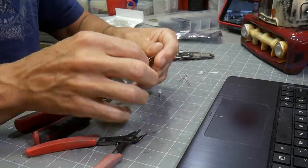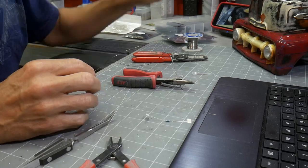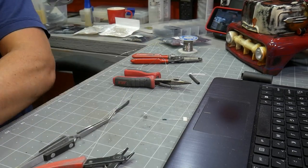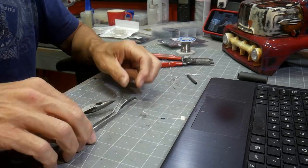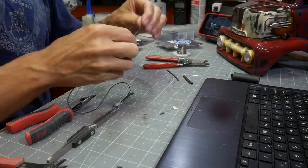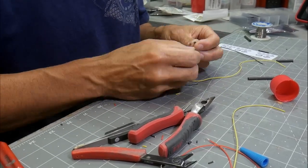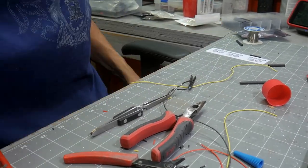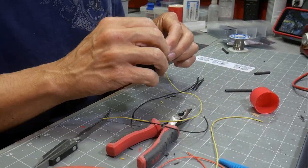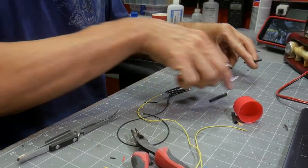One of the fun parts for me is doing the wiring. For the LEDs you use a resistive dropper — just go to any number of websites that help you calculate what resistor to use. You put in a couple parameters, pick the resistors, wire up the LEDs, and you can get really bright or really dim LEDs. They sell different shades of white and different colors, so it's really fun to play around with. The resistor recommended by the website was still a little too bright for me, so I just added an extra resistor to both lines and it dropped it down a little bit more.